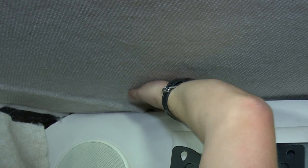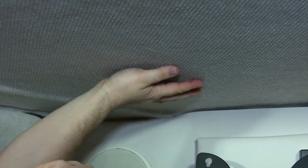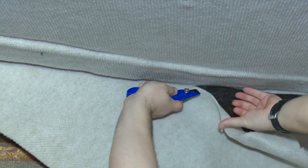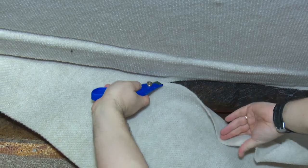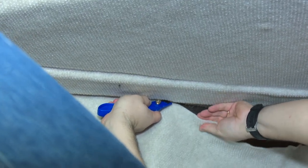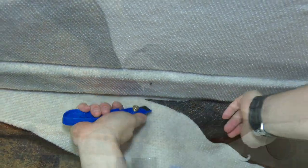And what I'll do is I'll pull that panel off and I'll clean this up on the inside. That's actually the anchor locker, so I don't want a whole lot of stuff hanging in there, but we'll clean that up later. And once again, you can see I'm cutting at the far side of my groove. That way my mating piece can overlap just a little bit, and then we'll cut them away.